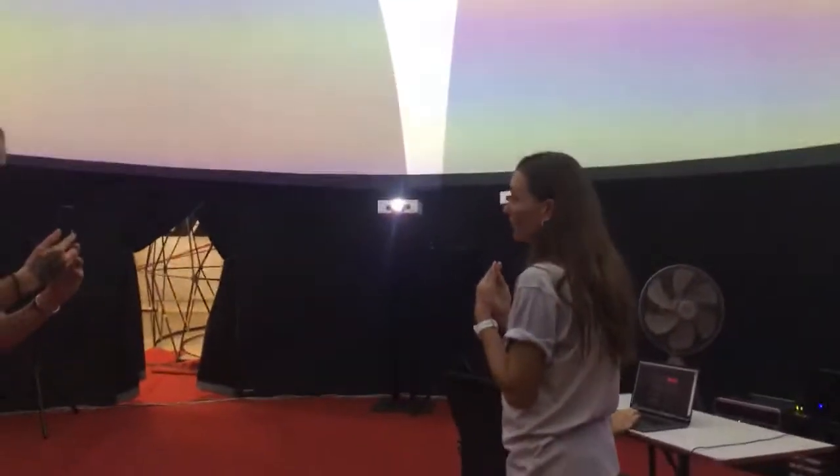So yeah, you can see the overlaps of the projectors here, and basically when we're calculating lumens and the pixels on the dome, you will never count those which are doubled on the overlaps, right? And the 8 full HD projector setup proved itself to be a really efficient projection setup. The image is going to be much better using 8 full HD projectors than using 2 4K projectors. It depends on the model, it depends on the brightness, and how you are going to use your domes.